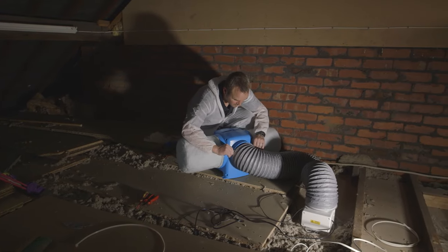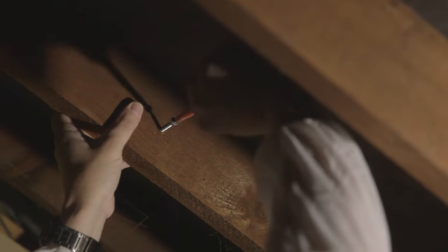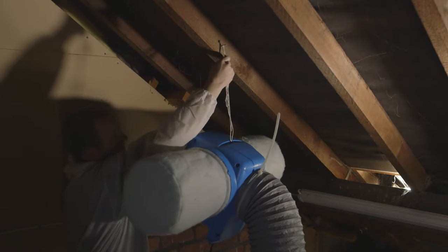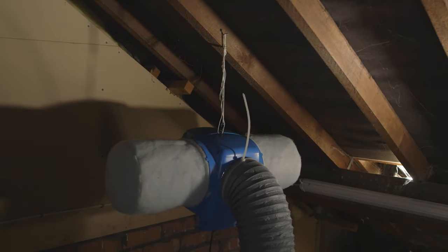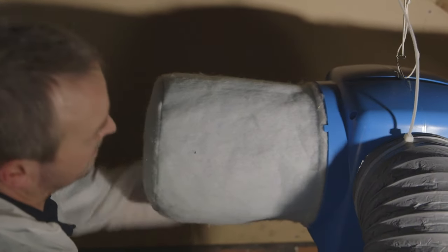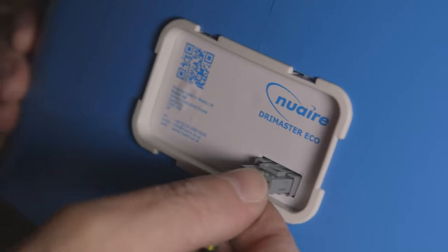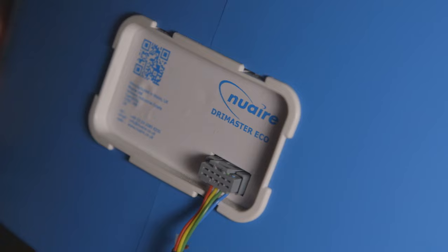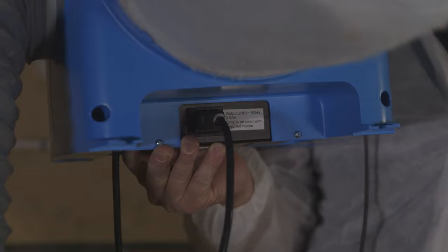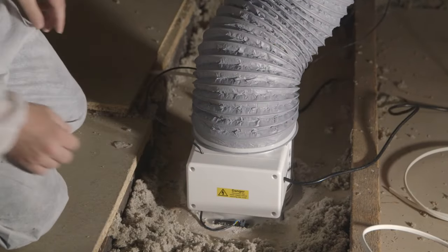Next, attach the duct into the fan and secure using the cable tie. Fix a screw to a convenient joist near the diffuser. If possible, suspend the unit approximately two thirds of the loft height to capitalize on solar gain, making sure the duct is not over-stretched. Once this is done, ensure that the filters are fitted securely. When the unit is in position, connect the data cable from the heater to the unit and then connect the heater mains cable back to the unit. As with any data and mains cables, ensure that there is a minimum of 50 millimeter separation between the power and the data cable.